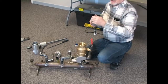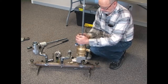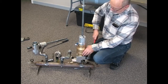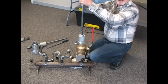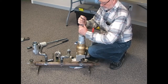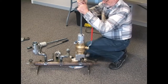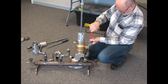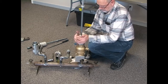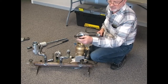Fully retract the magnet into the housing and attach the assembly onto the ball valve. Open the ball valve and slowly push the shaft down near the edge of the knurled section of the shaft. Do not touch the small T-handle when pushing down the rod. Then slowly retract the magnet into the housing, close the ball valve, bleed off excess gas, and remove the assembly. Remove the shavings from the magnet.